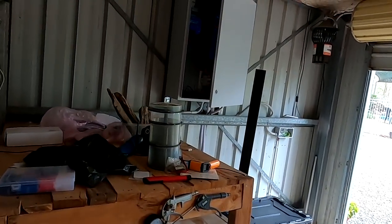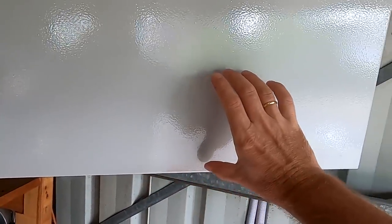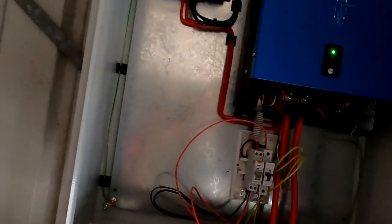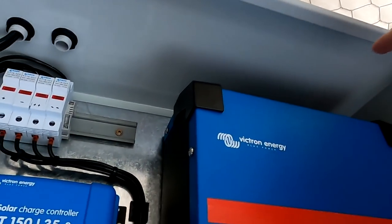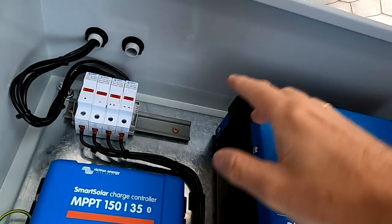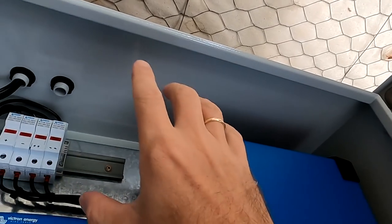I've got more of these dust filters here. I'm not sure at this stage where I will put the air intake. If I put another row of these dust filters down here with the filter included, so it sucks in the air from the front of the door and then goes through the cabinet, cools down all the equipment, and gets pushed out at the top again - bottom inlet, top outlet. The alternative was to have the fans mounted at the top of the cabinet pushing the air out to the top, but it is a bit hard to work on the cabinet now. I would need to disassemble all the equipment here again, probably take the cabinet off the wall to get the jigsaw running and do the cutout.